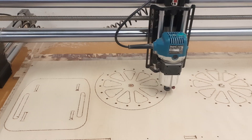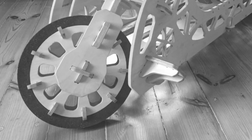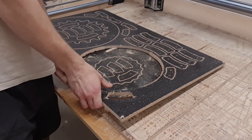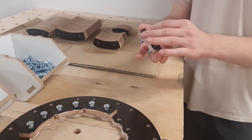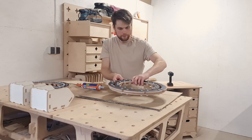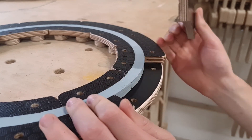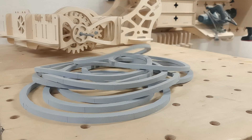Just like the other assemblies, the wheels have evolved quite a bit. The biggest update is the tire components. For the first prototypes, we used a ring cut out of rubber tiles. It worked quite well, however making them required waterjet CNC, which might not be freely available everywhere. So to create the rubbers for our wheels, we decided to use the same approach as our caster wheel design — making a mold and injecting a rubber sealant inside. We made a larger base part to which we could attach the mold walls, creating both the inside and the outside of the tire. Then we spray it with WD-40 as a mold release spray, inject the sealant inside the mold and wait for it to cure. After two days of curing, we can cut off the excess rubber and remove the mold walls. Since we have only two large molds and one small front wheel mold, we had to go through this process three times to make all the necessary tire rings.